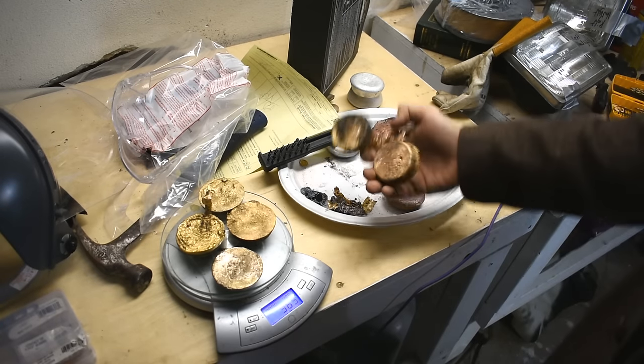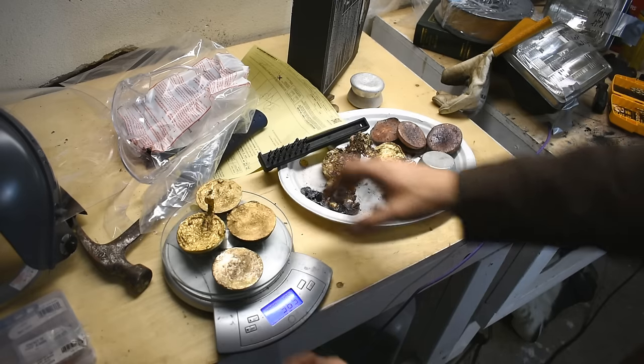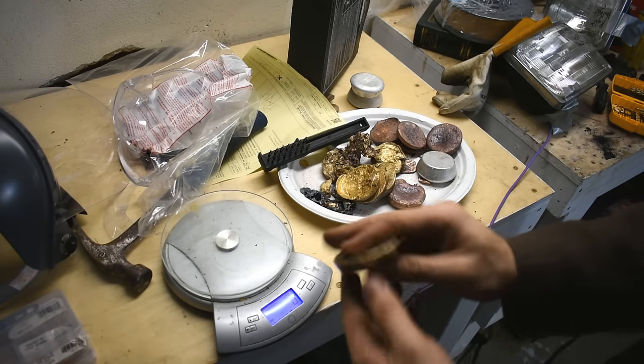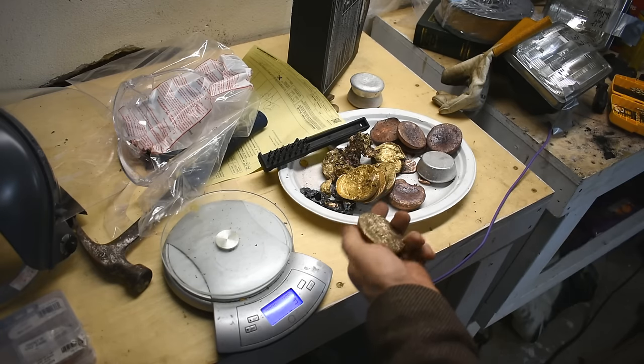This one kind of got chunky. Ended up with one and a half kilograms of aluminum bronze, a little more in these scraps — so that's about what I expected. What I did is I took this one and wire-wheeled it, and we're gonna run this one through some tests. There are a few issues that need to be worked out — for example, whether or not this is too brittle, and if it's actually as hard as I think it is.